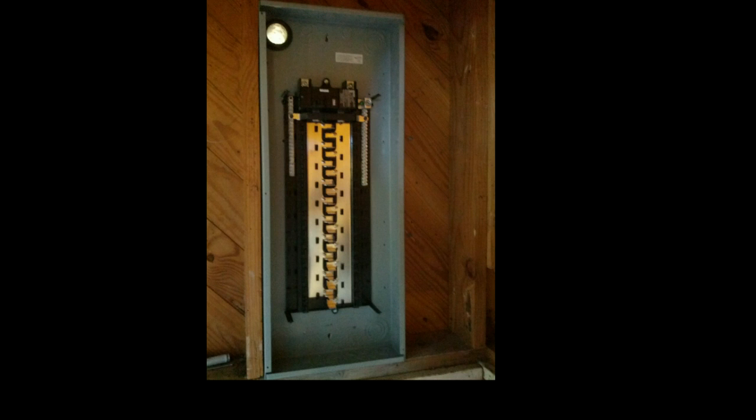The thing to do is put this panel up there, take out the knockout on wherever you're going to bring in the conduit, mark your circle, find the center, then take your hole saw or whatever you're going to use to cut the hole, and then you just pull the box off and cut your hole. The hole you see down below there is not a mess-up - it's actually the hole for where the conduit came in on the old box that I replaced.